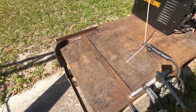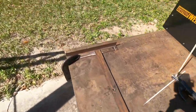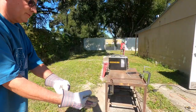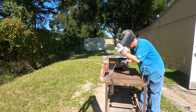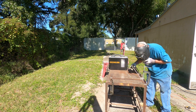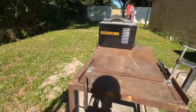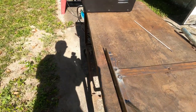I got it clamped up and to keep it simple I brought out the Harbor Freight arc welder. All we need to do is tack it together, so there's no point in getting fancy with MIG welders and TIG welders. I'm hoping to get a couple tacks on here to hold the whole thing together. We don't want to completely weld it — just get a couple tacks on there so we can cool that off and take it up to the truck and see if it actually fits.